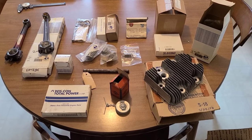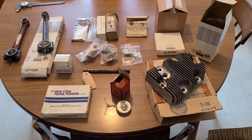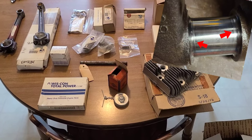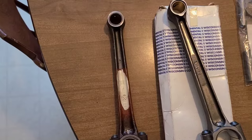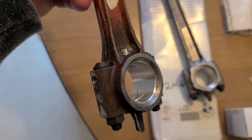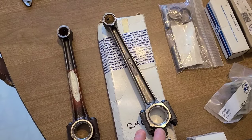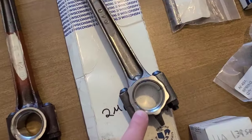One of the things in my last video we talked about was the crankshaft. I started to polish the crankshaft and up in the corner I'm going to put a picture showing you there's a definite wear mark on the thrust side of the crank pin. So what I've decided is not to replace the rod with a standard AEN Babbitt rod - just the steel rod machined to run on the crank - but instead to upgrade to an AEN L rod with bearing inserts.